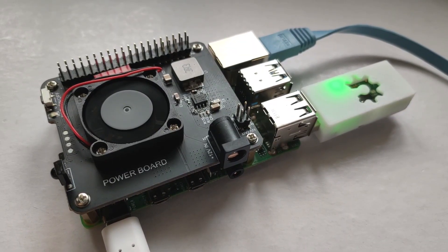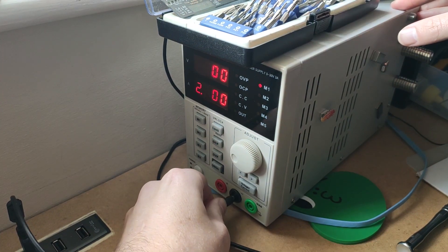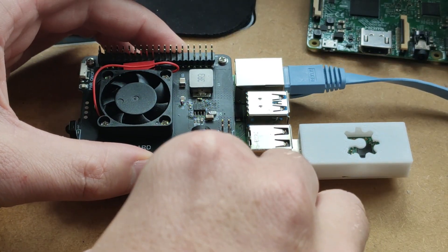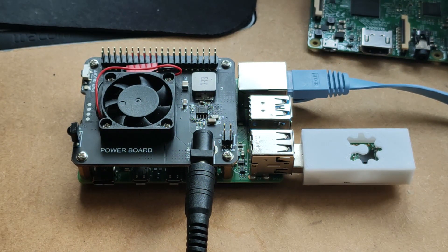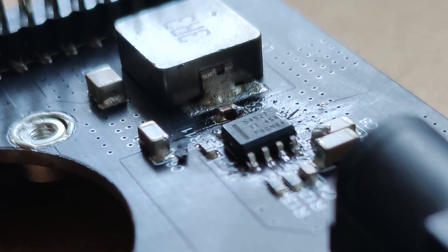This video is supposed to be a review for the 52Pi power board. I'm hesitating to give good marks for this board mostly because the intended use — supplying 12 volts to the Raspberry Pi and powering everything — never worked as intended. I quickly discovered that the board only works by attaching it to the Raspberry Pi and powering from the Raspberry Pi. So I took it to the Hackspace, and Tom — thank you so much Tom — investigated it, and we ended up replacing the power regulator.